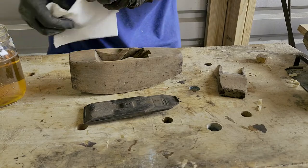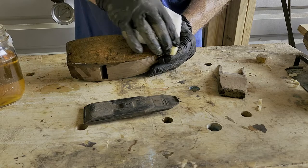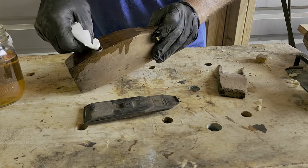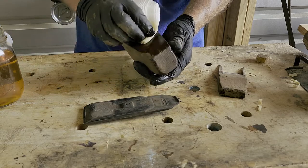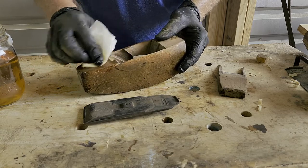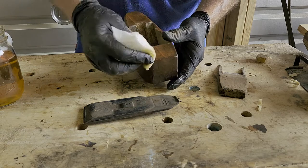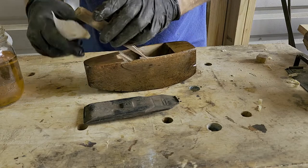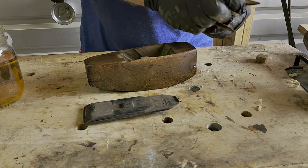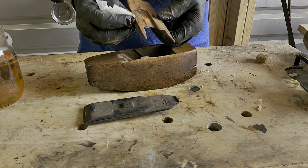We finished cleaning all the old dirt off of it — the patina is still on there. What I'm going to do is use shellac in case there are any exposed parts on this plane, so we don't want those to soak up any moisture. We're just going to put a quick coat of shellac on here, which I used on it originally. This gives it protection while maintaining that rustic antique patina look, which it should have.